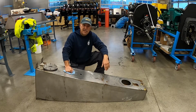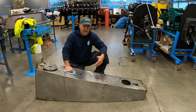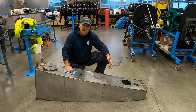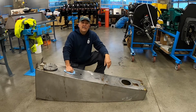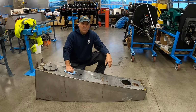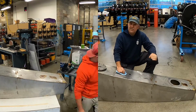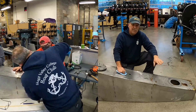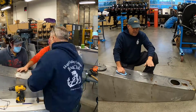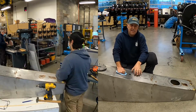This old diesel tank, I don't worry about it exploding. I drilled this with a regular hole saw that you could buy at Home Depot. I drilled it out and then I cut it with a scroll saw. Again, I wasn't worried about parts starting to glow or sparks shooting because it was a diesel fuel tank. Diesel's not going to blow up. Gasoline tank, a completely different story. Now that's applicable with a steel tank.